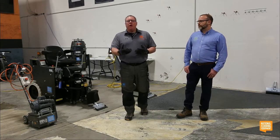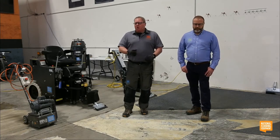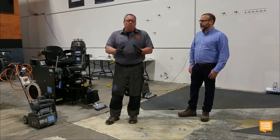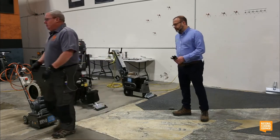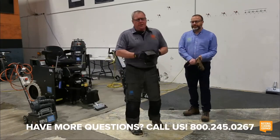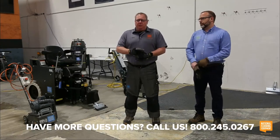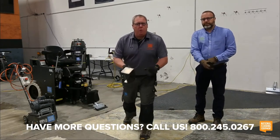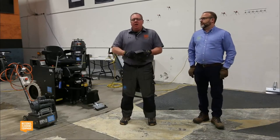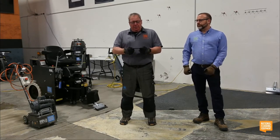The first thing we're going to talk about is double stick carpet — that's some nasty stuff. My general advice: if the job is double stick carpet, run away fast. If you can't run away, you definitely need to understand that National makes a self-scoring blade with four-inch wings specifically designed for double stick carpet.